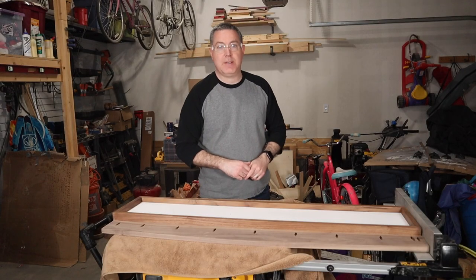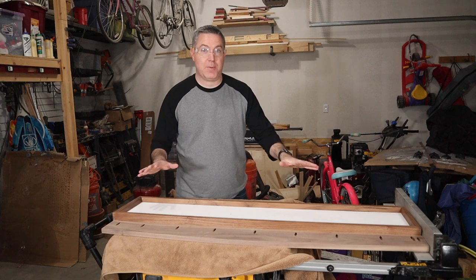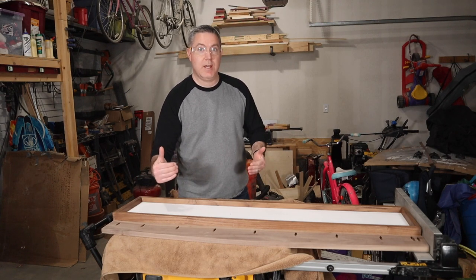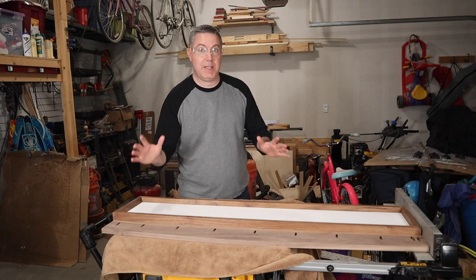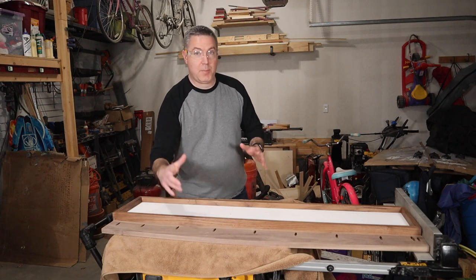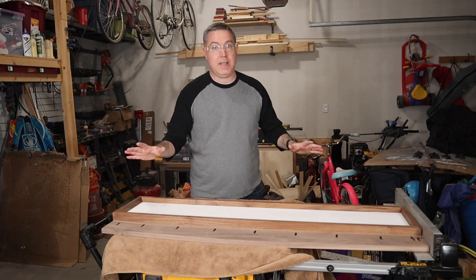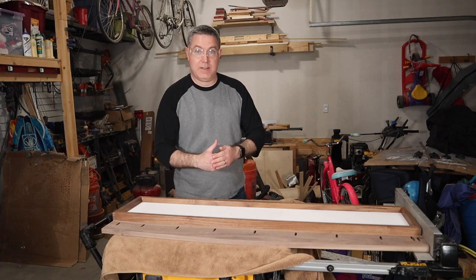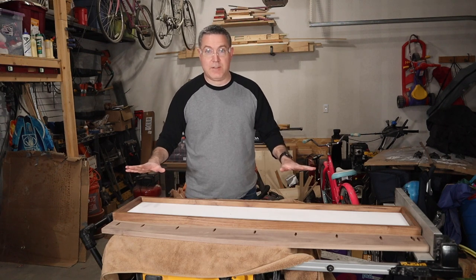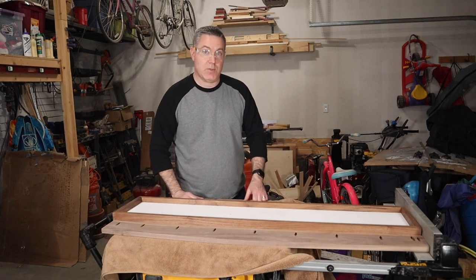It's time to get these two pieces assembled — I've got the top picture frame piece and the bottom hook panel that I need to attach with those pocket holes. I'm regretting not attaching the hook panel at the beginning before the frame was assembled, as it would have been a lot easier. I put down a towel to hopefully prevent any scratches and I'm going to go ahead and get these pocket hole screws put in.